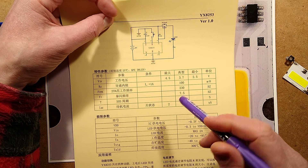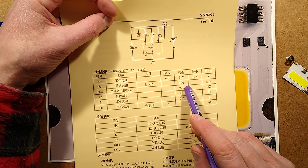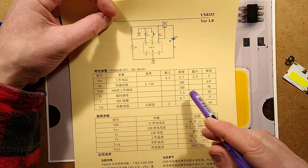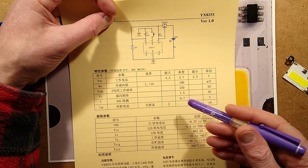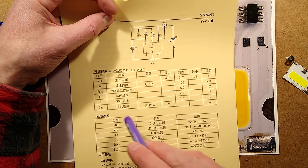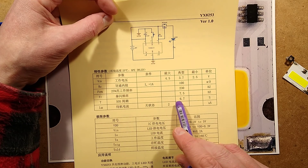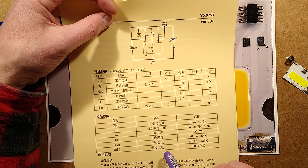You only notice the flicker when you swipe the light. That also explains the current readings — I took readings at 4.5 volts and 3.6 volts, comparing nickel-metal hydride cells versus fresh alkaline cells. The flashing mode is at 7.5 Hz. The SOS cycle timing is 6.7 seconds for the full duration.